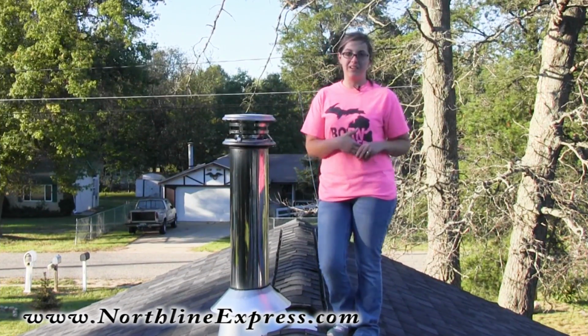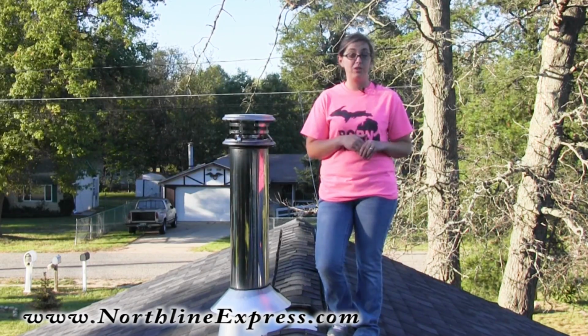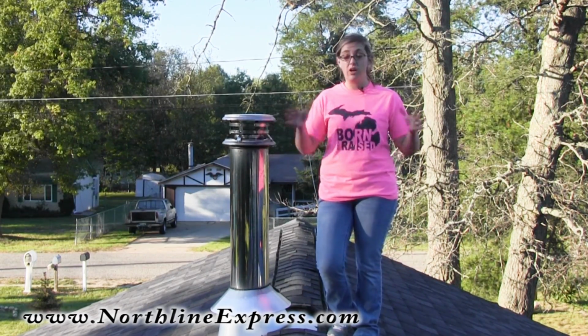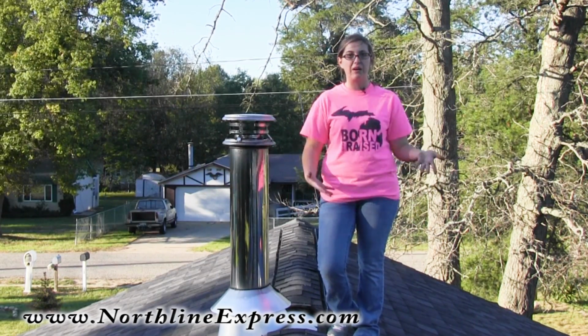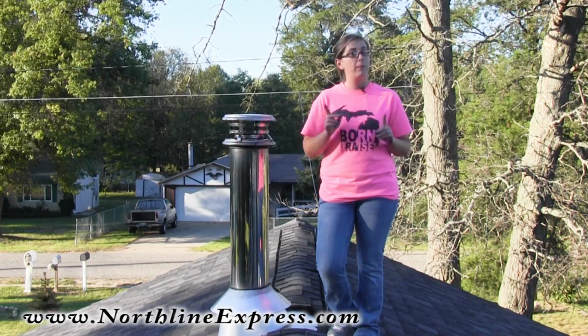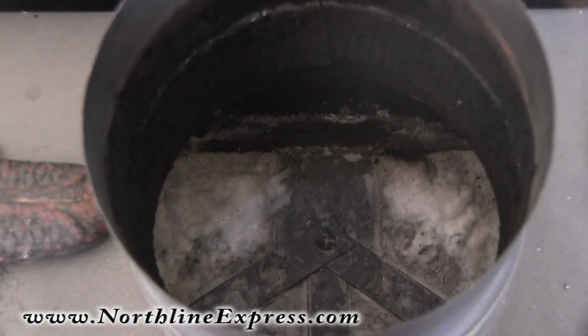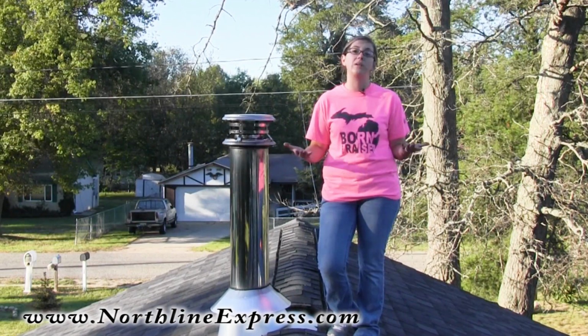And our final note here is going to be something to think about for the inside of your house when you're cleaning your chimney. With a fireplace, usually you are going to just cover off your fireplace opening and allow all the debris that you knock out of your chimney to fall down in, and you'll clean it up afterwards. But pay attention to your wood stove. If you've got a wood stove that's got baffling in the top of it because it's EPA certified, that's part of your reburn system. Most of them are going to be that way.